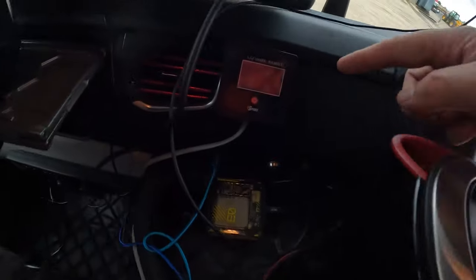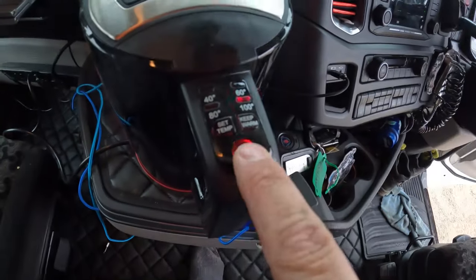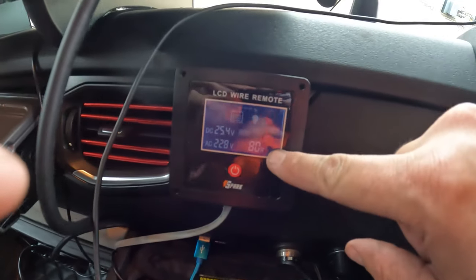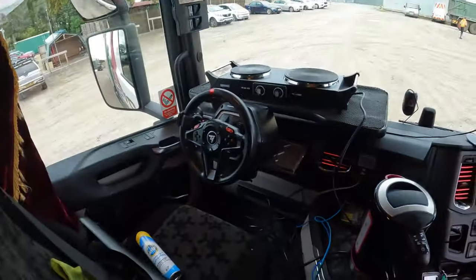How do I monitor my power? The inverter comes with this little device that tells you how many watts I'm running. The inverter is 3000 watts so I can't go anything over that - 2900 is the limit ideally. Let's put the kettle on - that draws a hell of a lot of power. Look - kettle goes on, straight away two and a half thousand watts. So I can have the kettle on and also the TV on. The TV is running 80 watts.